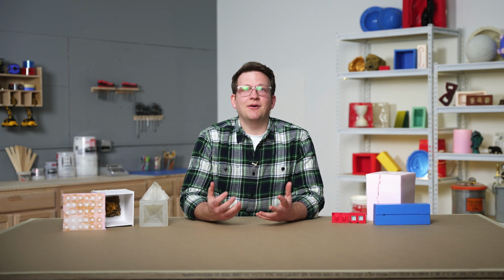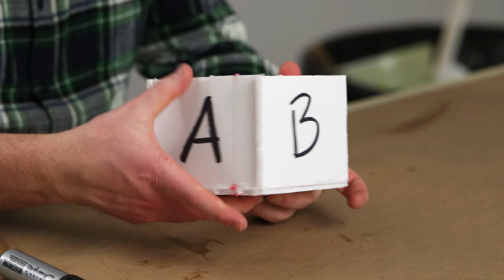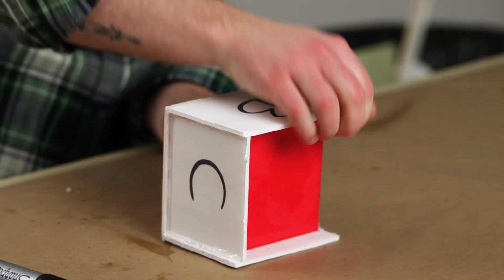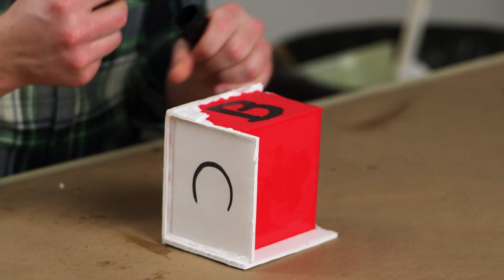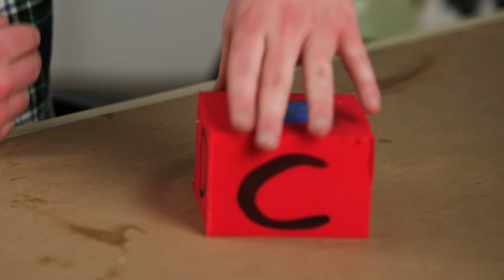To understand how our master is positioned, let's look at a few references. Our first reference will be any marks that we made on the outside of our mold. If we use these marks on our mold box and transfer them to our mold, then we can use these as reference along with our mold design to immediately understand how everything is positioned. This is especially useful if our mold is larger or if our master is completely obscured from view.